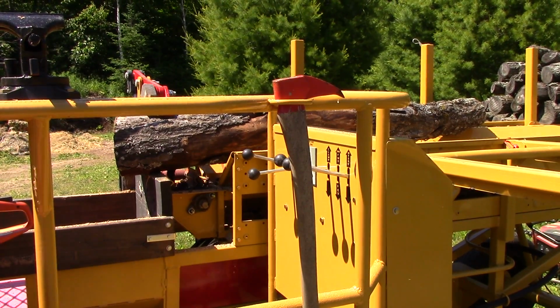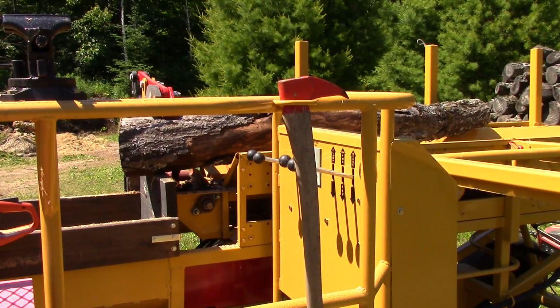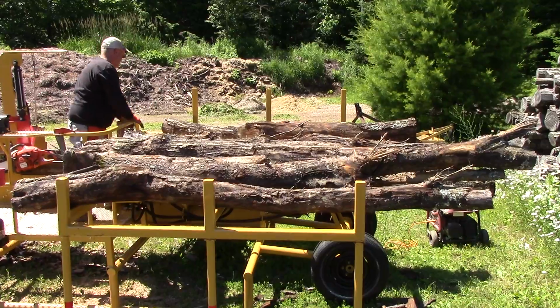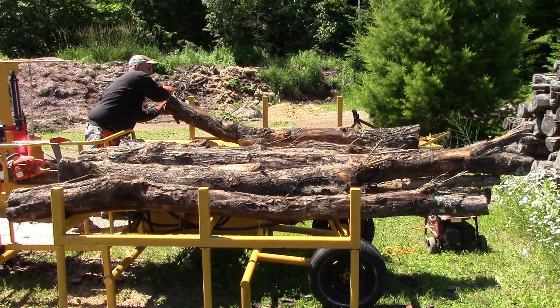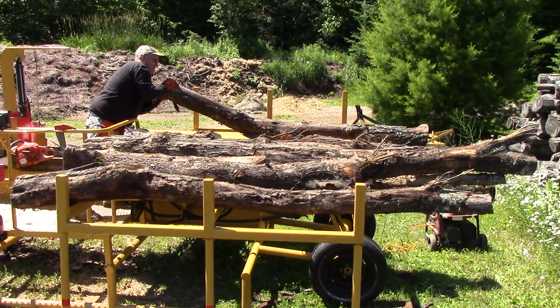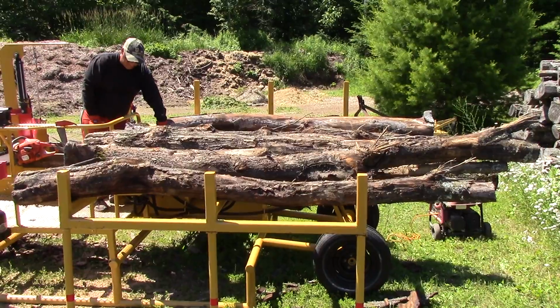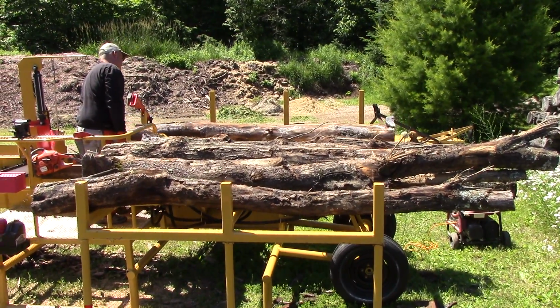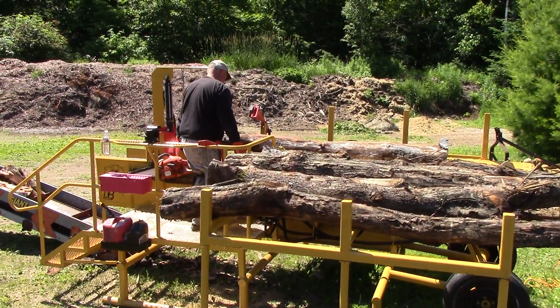I also have, as I stated earlier, the grapple bucket that Keven has designed himself, which is on the front of his tractor that he was using. That works really well with the 3/4 inch rod that runs around. It is 3/4, right? Yep. That runs around the outside, so when he grabs juniper bushes and stuff, the stones and the ground all fall through, but he is able to grasp the juniper bush and pull them out of the ground.